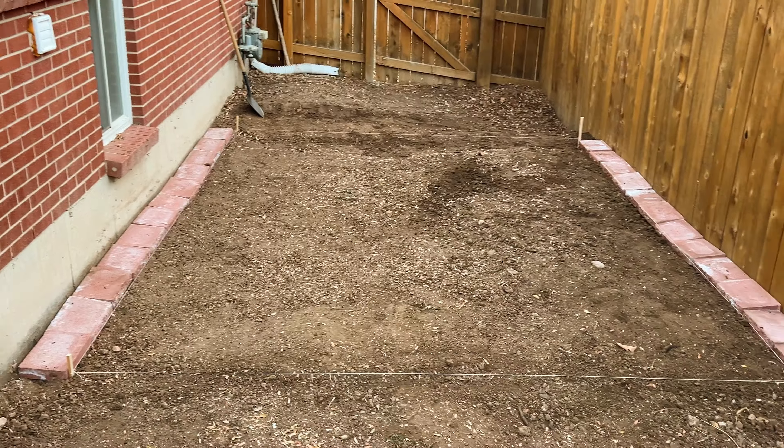Now I just need to go get some food, figure out how much more wood I actually need, pick that up at Home Depot, and hopefully get a roof on it before the sun goes down. It's only noon — not even noon yet. About an hour or two later: I went ahead and nailed these rafters in. Next I have to go back to Home Depot — I don't have enough sheathing for the fronts. I do have some but when I cut it, it's not the right size. Timber's eating a coke bottle. I should have enough OSB for the roof, I just need maybe two more pieces of sheathing.